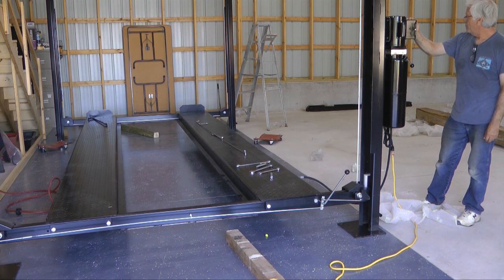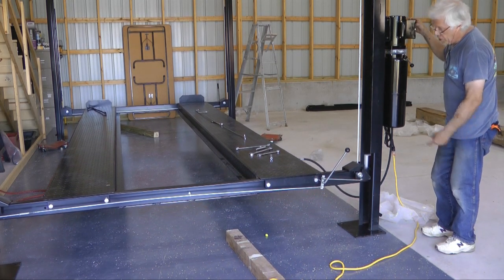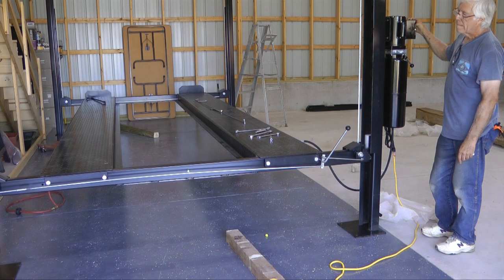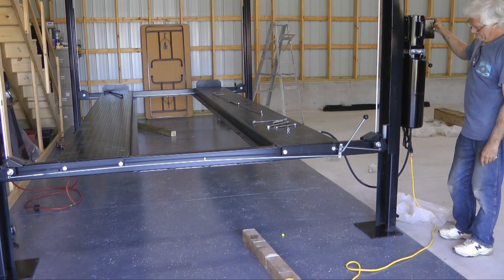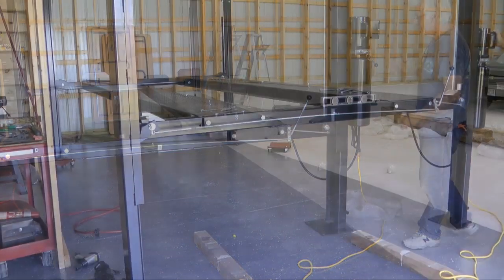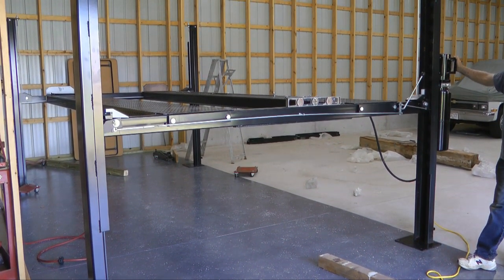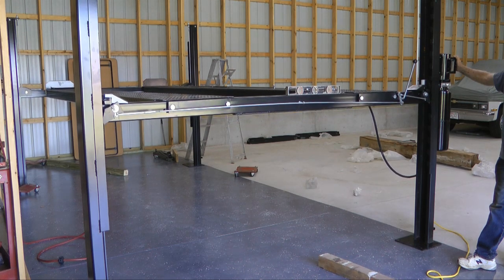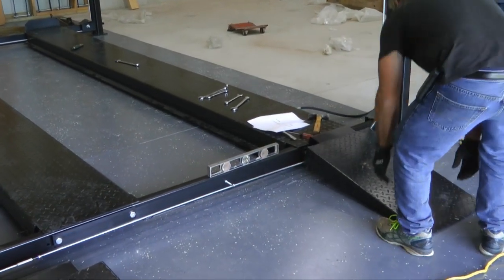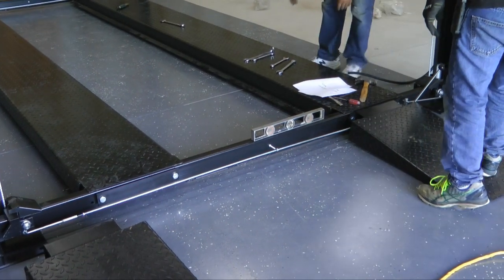We power up the motor and the two horizontal members lifting the treads work just fine. There is a little bit of a jerky motion until we get those four cables adjusted just correctly. Those clicks you hear are the automatic locking system to prevent downward travel unless you pull the lever. Success! And of course we have some ramps that attach to the end to finalize the assembly.